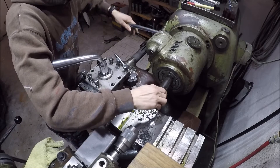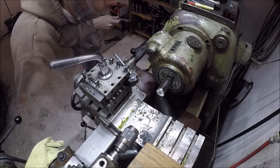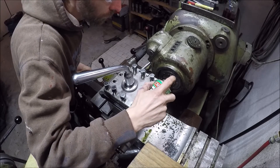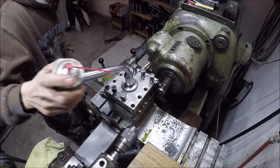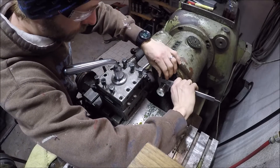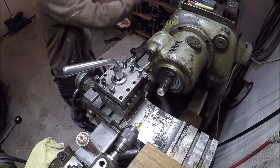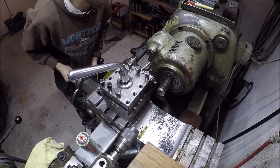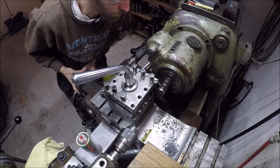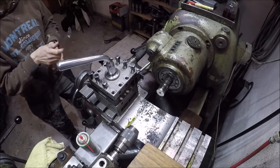I'm starting out with a piece of round stock and this one is 30 millimeters, so the finished OD of the jacks are gonna be about 29 millimeters. And as you can see I'm using my collet chuck, which is really working out well. Using my cutoff tool I make a groove with a diameter of 25 millimeters and this is gonna act as a marker when I'm turning my taper.